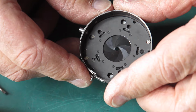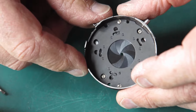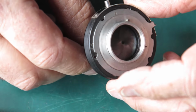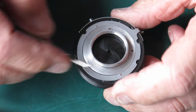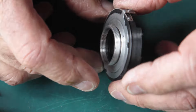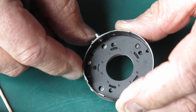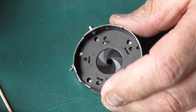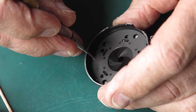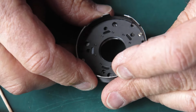And if that's the case, what you end up doing is you run the screw in as tight as it wants to go. You support the head of the screw on a post from underneath and you rivet over the end of the screw at the back, so it becomes a rivet instead of a screw. That's commonly what's done to rescue a situation like that, unless of course you've got lots of spare parts. But generally we do not have lots of spare parts for things that are as old as this. You make do with what you've got.